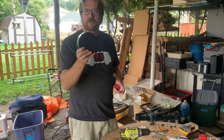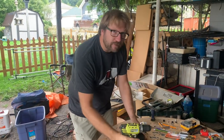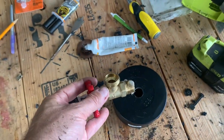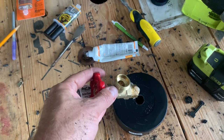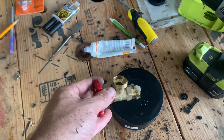I'll do the same thing on the inside of the connectors to create a stronger bond. I'm going to put a hole right in the center of the 4-inch cap — that's for the spigot to go through. I'm using a 3/4-inch bit to do that, because it's the exact diameter of the spigot. I'll thread it through the plastic and put a little bit of silicone on the threads as I put it in.